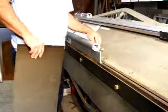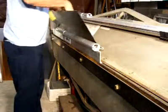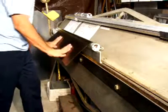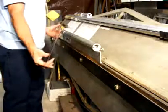In this step, we're going to use the J die again to do a radius bend with no flange on it. Stick the material right in the J die, and you pull it around just like all the other parts. The edge of the material is held in on the edge of the die. Push it around to the degree that you want. If it's not enough, push some more again and again, then you take it out until you're happy with it.